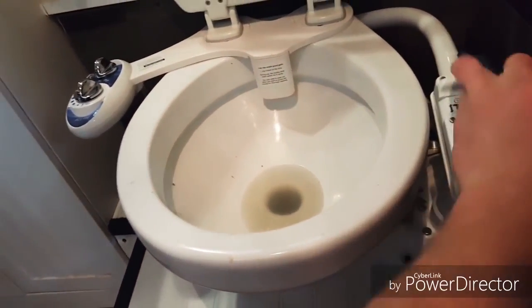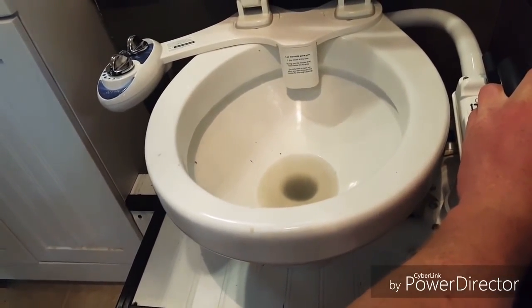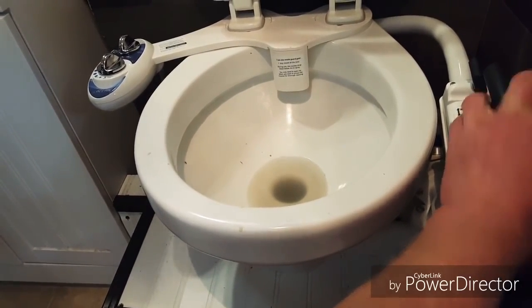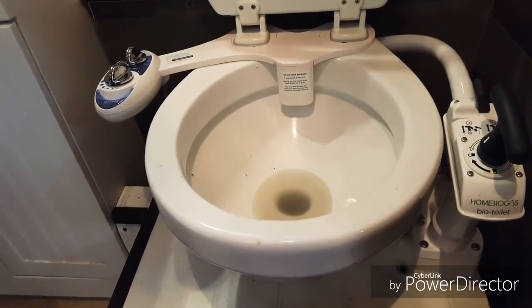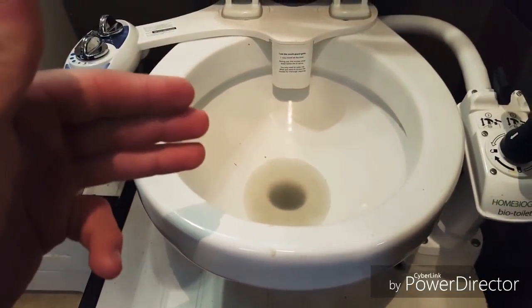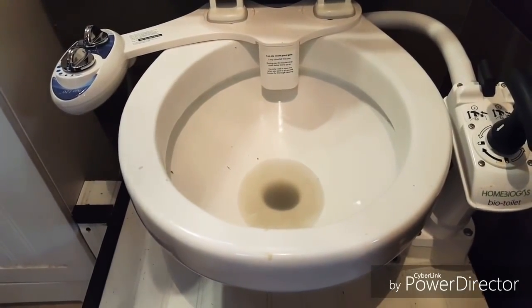You have a pump here, and this is what you use to pump everything out and pump everything back in. Something that was not made clear to me is how the system actually flushes. I was not aware that there was a pump that can pressurize and push it out — I assumed that was so, but it wasn't made very clear to me. One of the cons of having this toilet is your flush water is always going to look murky like that, and it's going to have a little bit of a musky smell from stale water.